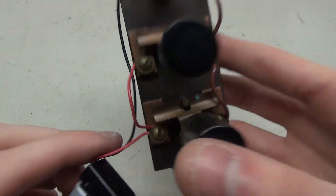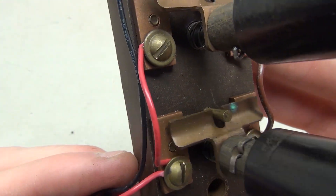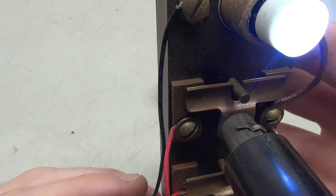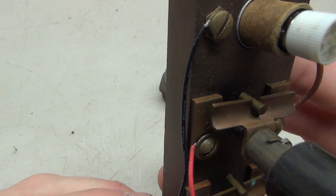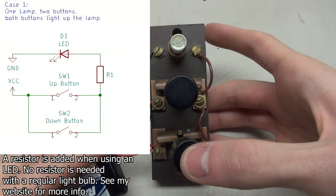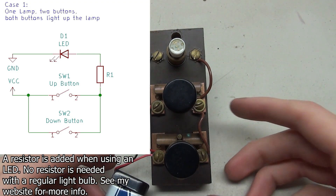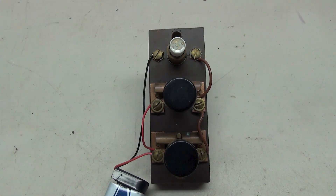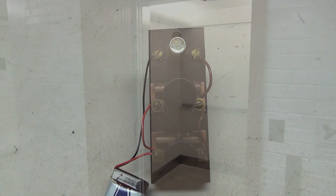In my case I have two buttons to control one light. We obviously have the two buttons, so when you push them down either button can get pressed and the light will turn on. The way this is done is by this circuit on the screen here, and all these circuits that you will be seeing are posted on my website so that you can see those as well.